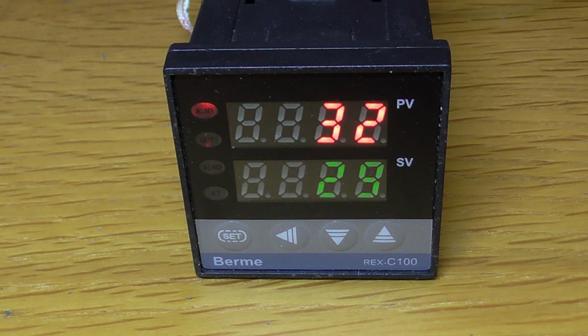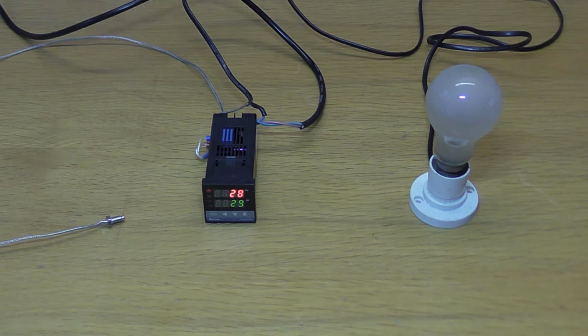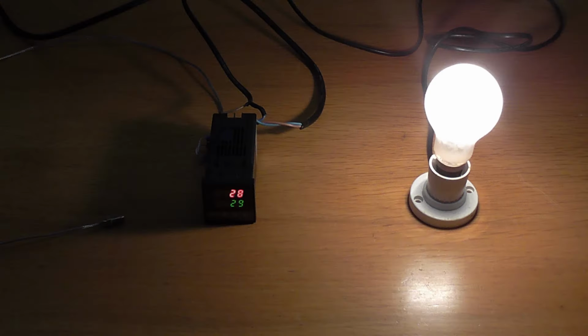I'm using this cheap PID controller to run the kiln. This is really overkill. The temperature will change so slowly that I could easily modulate it manually. I'm really only using this because it measures the temperature with a thermocouple. A thermometer with a probe on a lead would do just as well. I place the thermocouple on top of the board, turn everything on, and wait.